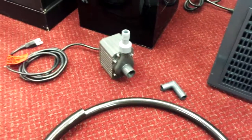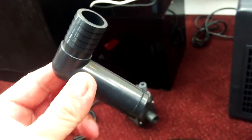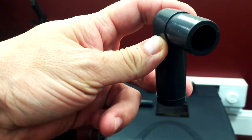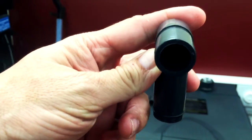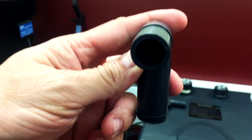Alright, we're going to connect the three-quarter inch tubing to the system. We have an in and then the out over here — there goes the in and there goes the out, so you've got to be really careful where you put everything. The connectors are half inch and go on top of the system. Then you put the washer in and the nut on top of it and secure it down — hand tighten it. Don't over-tighten this because if you do you're going to have problems with the system leaking.